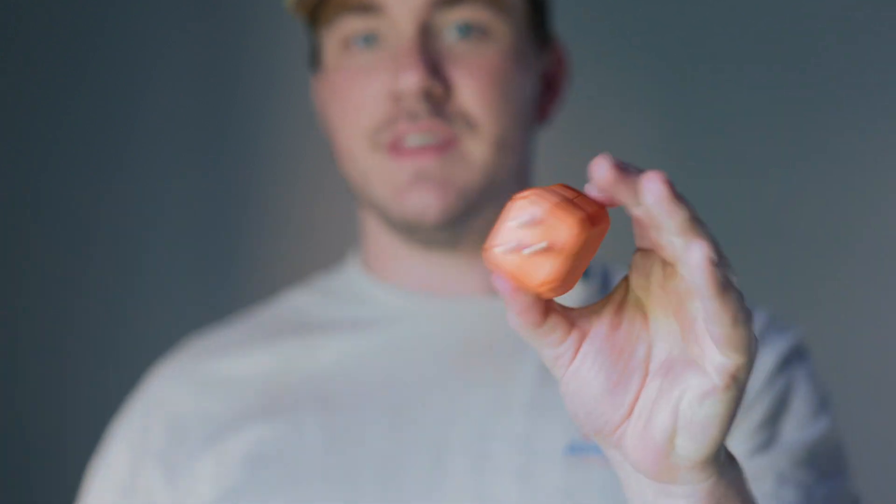When you plug the GFI portion in, you can go check the panel from there. The power for this plug-in comes from the actual circuit, so you cannot trace dead circuits with this — this is for tracing live circuits. Super useful. The other end is battery-powered and it comes with it; it's lasted a long time — I actually still haven't changed this one out. Let's go ahead and trace out an outlet back here and I'll show you guys from the panel.